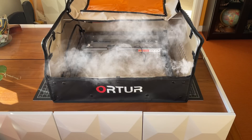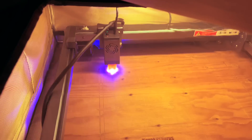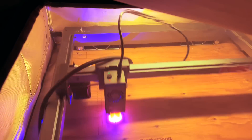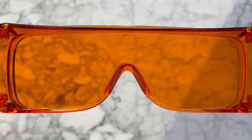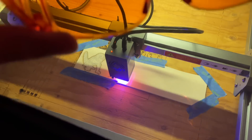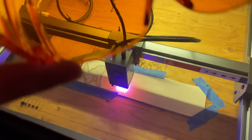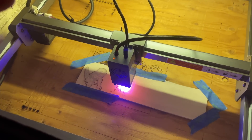This will keep the light, fumes, and fire contained. It has a tinted window up top, but the blue light is still visible — I can see it. Which is why we need eye protection. These are the glasses it came with. Laser goggles have a specific wavelength and optical density, but these ones are nowhere to be found. This impact rating is all I could find. They do appear to block blue light, but I don't know what kind or how much. Lasers are inherently dangerous and this is important information.